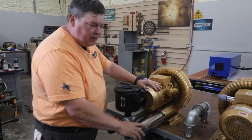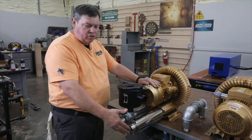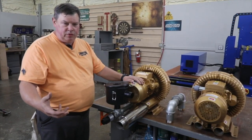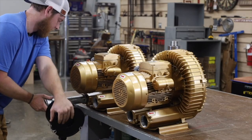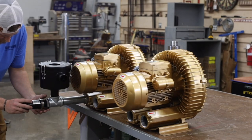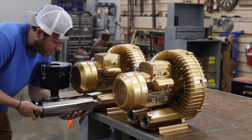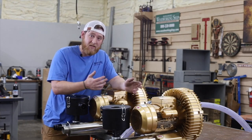On this side you're going to have a stainless steel muffler — this is called the cool side. The other side is called the hot side. Everything coming into the cool side can use PVC or plastic; you can use lower-temperature items to move the air. The hot side is going to have to be metal. You will want to use metal pipe compound or sealant tape on all of your threads when installing these fittings. Mount the canister filter to the pipe provided and attach your bypass valve to the end. The muffler is always installed on the right side of the motor — this is the hot output from the motor.